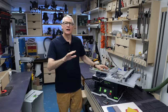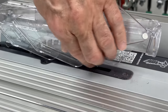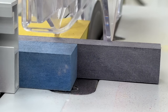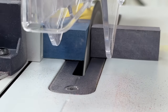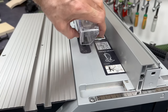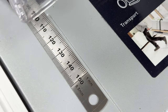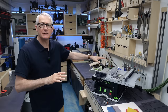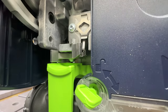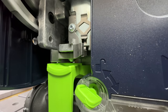On a purely personal note, I find the segmented blade guard that comes supplied with the saw a bit irritating. I'm told this is an EU directive as the segments help prevent the waste coming back towards the user, but I find it just gets in the way and can't easily be moved. It makes it harder to reference off the blade, and even though the blade kerf is marked in the bed of the saw, it's not particularly clear — I'm just more comfortable working directly off the teeth on the blade itself. Overall though, I do like the tool-less riving knife change and the fact that there's only two screws holding down the blade insert, and the saw cuts extremely cleanly.